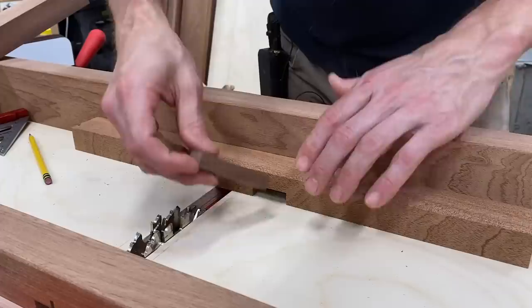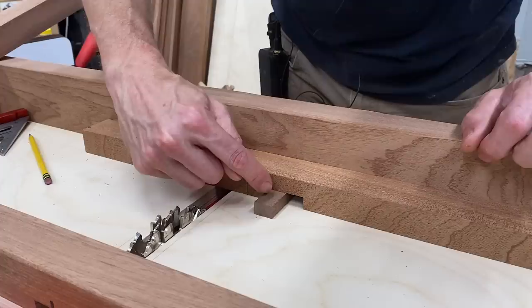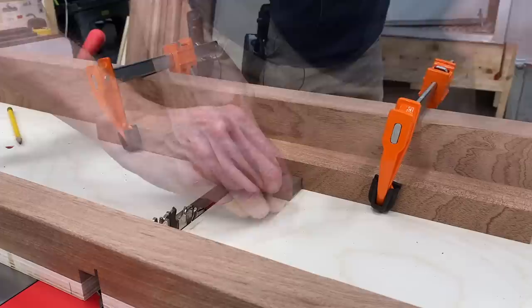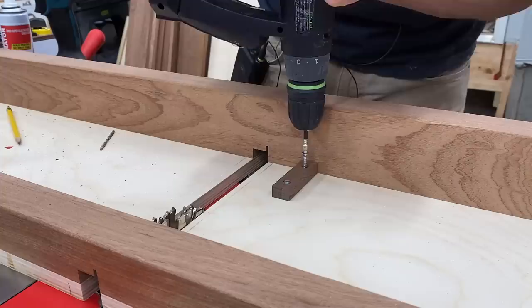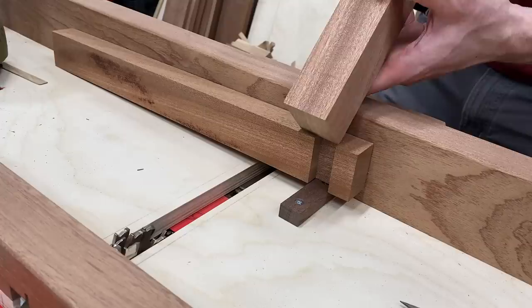The spacing between each slat is one inch, so on my test piece I used a 1-2-3 block and made a mark at one inch. If I move this over and line up my cut line with the edge of the blade, I can put my stop block in here. I make my first pass and then slide it over where the outside edge of the block gives me the exact width I need, then just keep moving down — each one gets two passes. With a little CA glue I secured that block in place with activator and then a couple of screws.